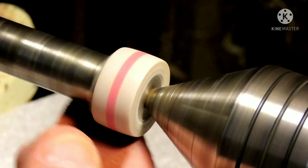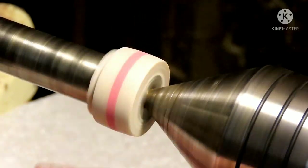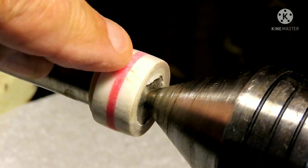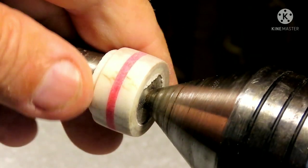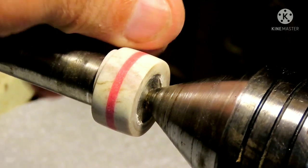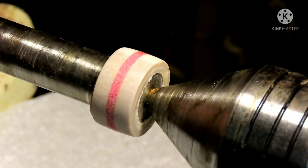Slow the speed down and just let the sandpaper do its job, keep it moving. You should never use pressure with sandpaper — if you hold pressure on it, it'll get hot and you'll get a burn. A burn will change the color of your inlay. You're going to get some of that most of the time anyway; a little bit adds character, but you want to avoid it or it can turn yellow, sometimes black.